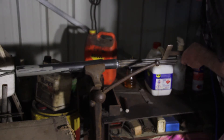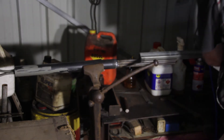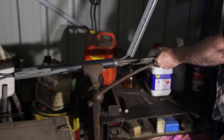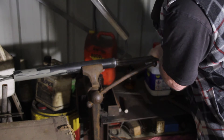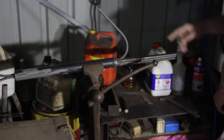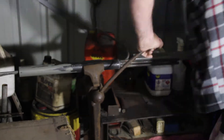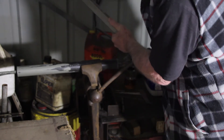It's time to bend the spokes on this. I'm going to try and do it here in the blacksmith's vise, but I'm not sure whether I'm going to get a good enough grip to be able to do that — so if it doesn't work I'll just take it over to the other vise. The blacksmith's vise is over 100 years old — not got the best jaws in the world, good for some jobs, a bit long in the tooth for others. Got a big piece of SHS here — any bit of pipe will do, anything hollow. Give yourself some leverage so you don't have to work too hard, and just keep moving it back until you get a nice radius on that bend. Remember to rotate so you're always bending the one straight up or always out to the side — rotate it around and do whichever one works best. You can just eyeball the angle at around 45 degrees, and just make sure she's straight with the shaft.